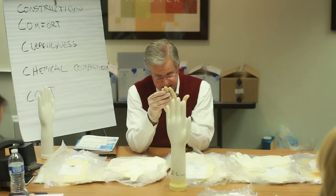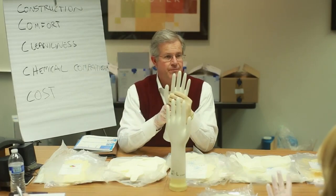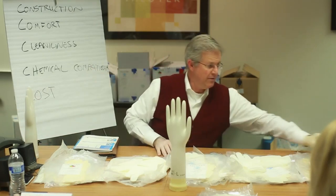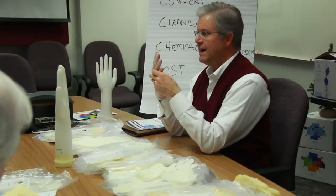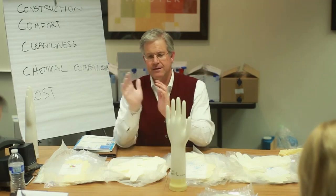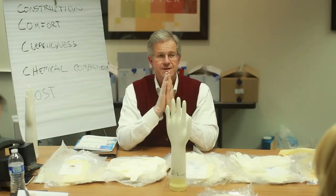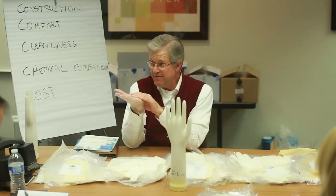The construction for latex is basically a micro texture throughout the glove, and the texture for a PVC glove uses a former that's all smooth. A PVC glove comes from a polyvinyl chloride derivative — it's a petrochemical derivative, meaning it's very stable, like plastic, lot to lot to lot. When a PVC glove is dipped it's basically a clean process, and when it's stripped from the former it is a clean glove. PVC is dipped without any powder in the process, so think of it as a clean process.